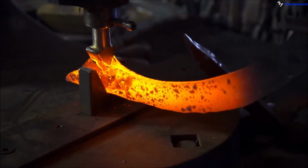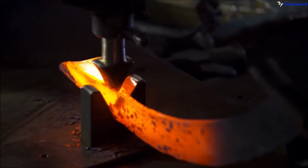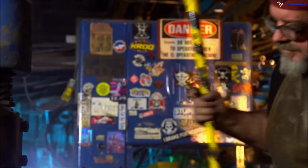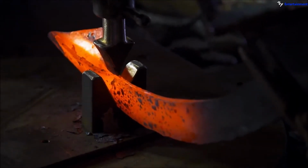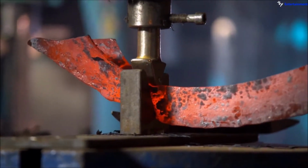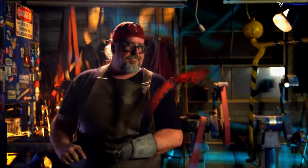The cutting edge has been the main challenge. I spent about 6 hours forming a cutting edge, and when I went to split it open, it literally split open. And you'll hear that little tink, which means that you develop a crack and that everything's just junk on the floor. It ripped and folded in. It thinned down too much, and it ripped. So this is what we refer to in the business as catastrophic failure. So I'm just gonna make another one that meets my quality standards.